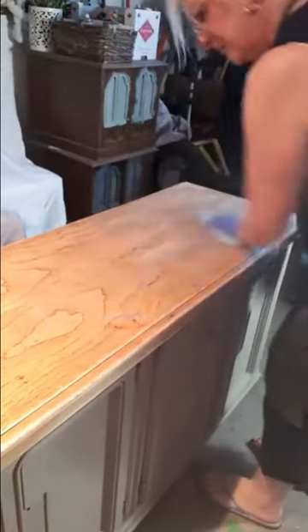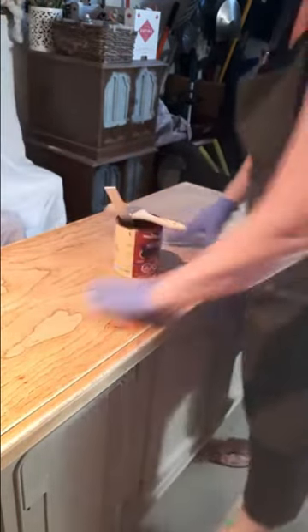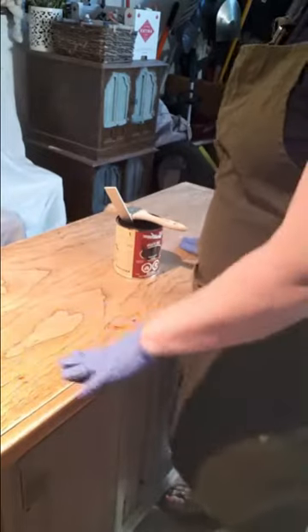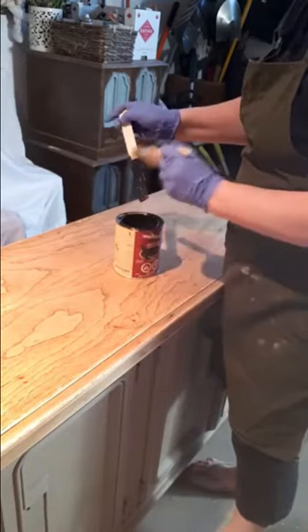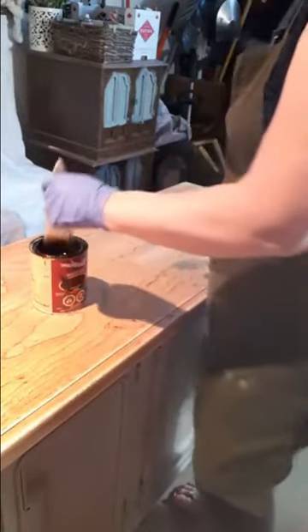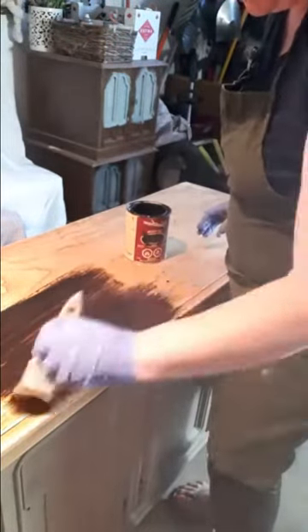That's all the real prep. I've sanded it with a sander — first I stripped it with paint stripper, sanded it after the paint stripper was off and dry, then shellacked it as my wood conditioner. The shellac soaks into the wood grain after sanding, raises the grain slightly, and fills it in a bit. When you go to stain over the shellac — and you can always stain over shellac — it makes your stain apply evenly.